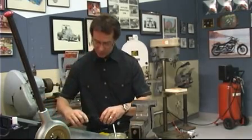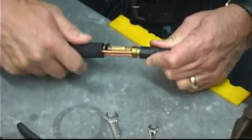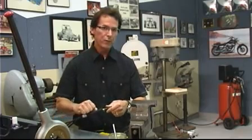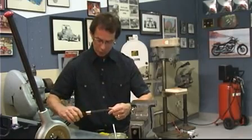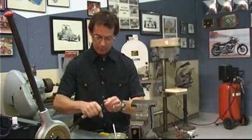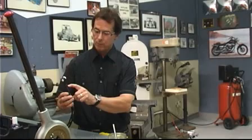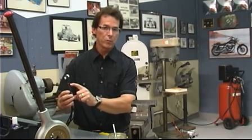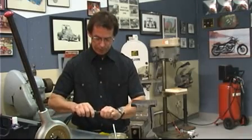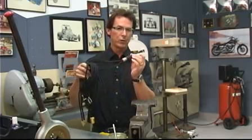Now that you've made the connections, straighten out the tubes and hoses, and slip the handle up. Some hoses can be tight, so don't rip the fittings or the hose when you push the handle on. Get the handle up close and then simply thread it on to the desired position. Make sure the handle is fully seated against the silicon rubber or torch body so you don't get any high frequency leakage in the area where you're holding the torch. Tighten the handle up and that's your completed TIG torch assembly.